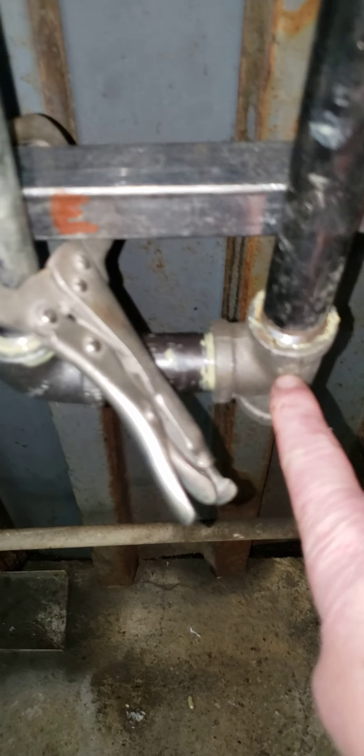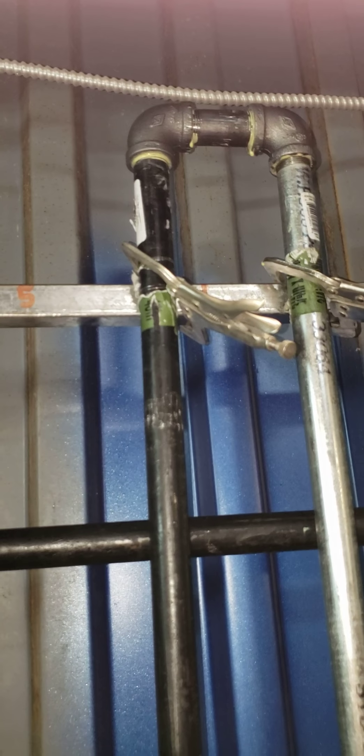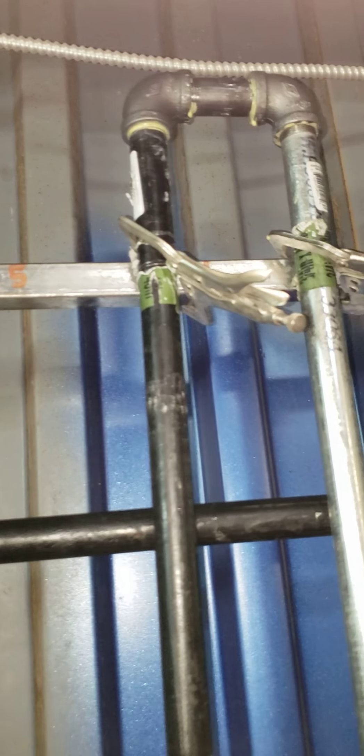There's going to be a drain there. The air goes back up to this side and it loops over — those vice grips are there just temporarily to hold it in place so I can tighten everything up, because everything just kept twisting and buckling in every which direction. Each loop as it goes, the air cools down and the water condensates and settles to the bottom, and there will be altogether about six drains.